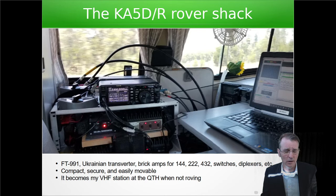Find your community. There are great Slack communities of VHF contesters. Find your people. Our rover shack, quite simply, is a 991 with some switches and diplexers. We switch basically between omni and beams, whether we're run-and-gun versus stop-and-shoot. I found that there's some merit to having access to both omni and directional antennas while we're running gun as well.